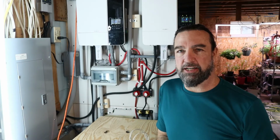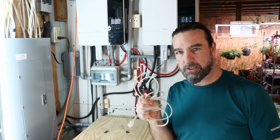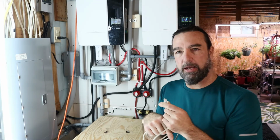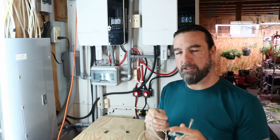So I recorded that entire process with no microphone on, so I'm basically going to update everything right here. I made a crossover cable. I made the pinout on the cables from 1 and 2 to 7 and 8, as was the manual's recommendation.